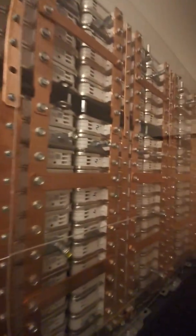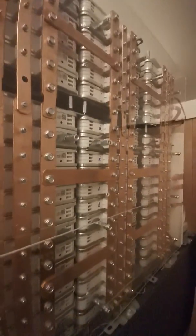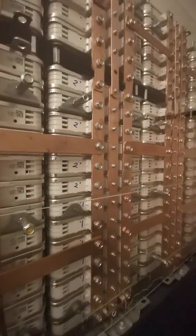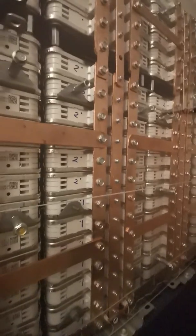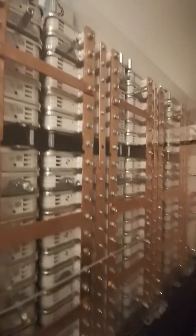The question comes with connecting in parallel and in series. This lot I've got here, as you can see, are a whole lot of parallel stacks that are then connected in series. The question comes with the charging and discharging amperage — the Nissan Leaf module itself is reasonably heavy with its connections, but it's not designed for hundreds of amps. It's better suited when the load can be shared, especially when you've got them in parallel.